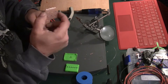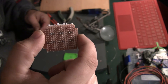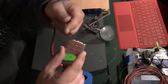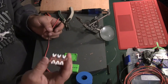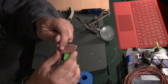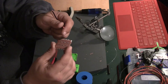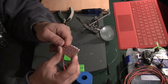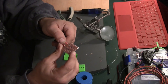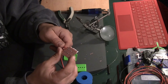So here is where we have to decide how we're going to run our traces. We have to hook up our power and then run that in the correct path to all the connectors. We're doing it in parallel, so that just means power goes to each power. We could run power all the way around, or we can just split it off both sides. And then negative goes to each one and goes all the way around, but they don't reconnect — unlike a serial connection.